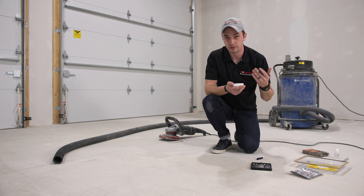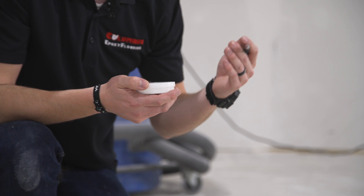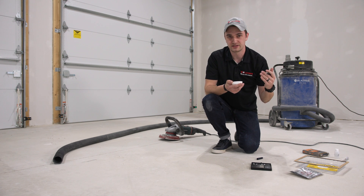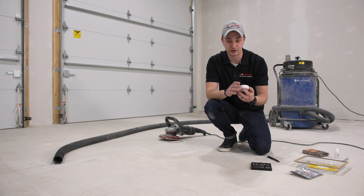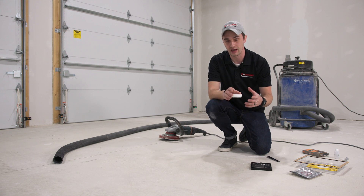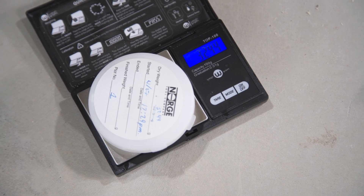This test is going to sit between 60 and 72 hours. After the allotted time, you pick it up, enter all the collected data into a calculator, and it will output a number in pounds — that tells you how much vapor transmission you have and whether it's acceptable for your coating. One important note: make sure the cap is on the dish both when you weigh it initially and when you pick it up after the test period. Weighing it without the cap will skew your results significantly.